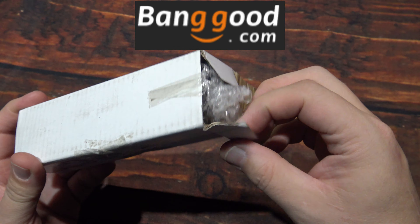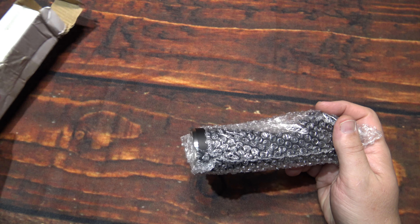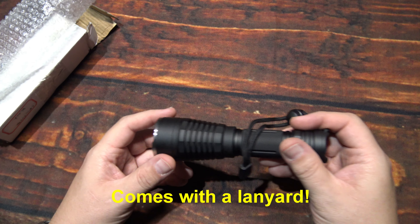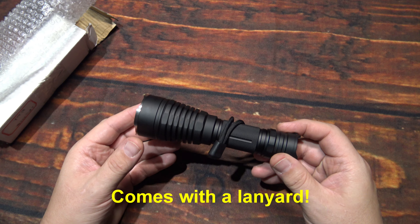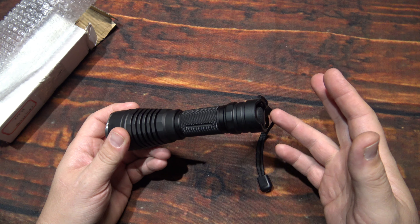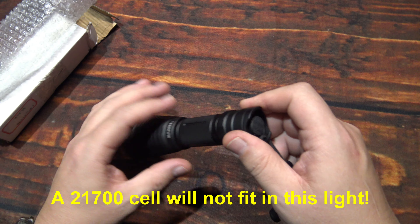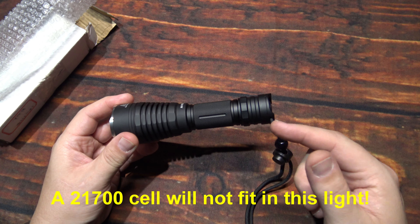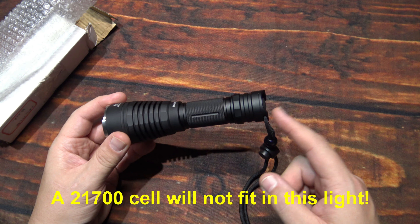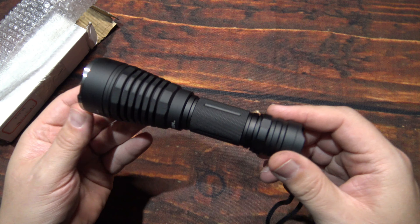So let's wait no further, let's open it up and see what's in. I did do some preliminary tests on this light and the results were pretty good. According to the website this can run on a 21700 cell or an 18650. I tried 5 or 6 different 21700 cells — they will not fit in this light. But I did find a battery that will fit: the 20700 cell, which can give you that longer run time. I'll bring that out later in the video.